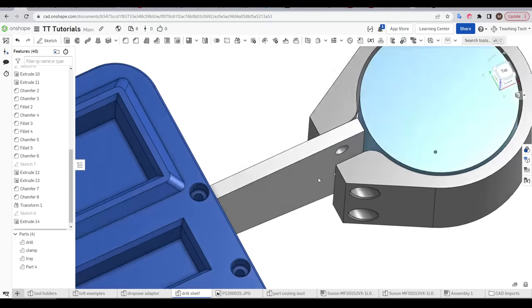So why did we remove this material and leave this crisscross pattern? When slicing this job I upped my perimeters as well as my top and bottom solid layers, and put the infill back up to 55%. When we look at the G-code preview, we're reminded that the perimeters are much stronger than the infill even at this high percentage. I think that this part with all of these perimeters means we're going to have a lot more plastic where we need it, compared to if the whole thing was just infill. It's visually interesting and we should use less filament compared to a solid part. This bracket was printed in PLA and it took a few hours, and in the direction that we need it to be strong, it certainly feels very rigid.